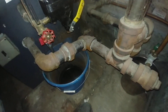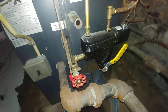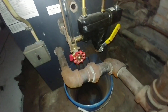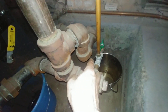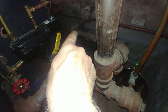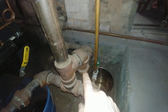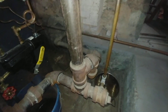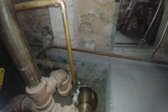Right now we're allowing this boiler to cool. I'm going to see if I can put that back together so that it can be taken apart and cleaned a lot easier. It would have been nice if the previous installer had installed a drain on this wet return here. There's a lot of potentially contaminated water trapped in here, and I'm not going to go there right now — just going to leave that alone.